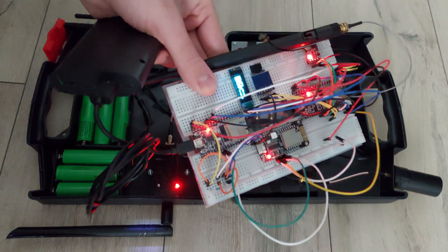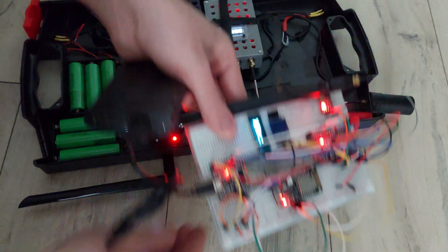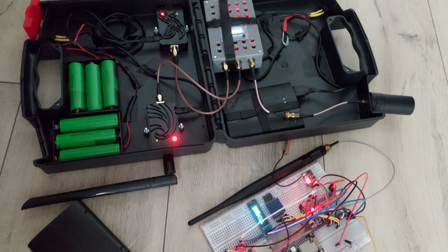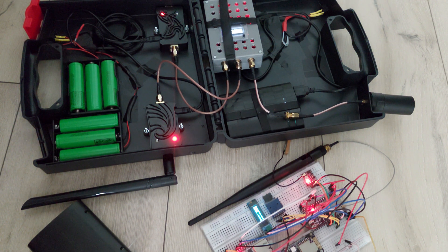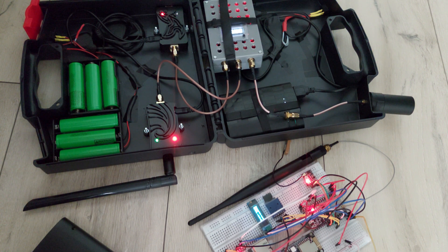I will try to do a comparison with this wardriver, but it has some issues because the jumper wires are very thin and I think the breadboard holes are now larger, so the connections are not very secure — sometimes it gets an unexpected error and resets. I had a video about fixing this if it disconnects when it tries to boot up. I spoke to Joseph and this issue should be resolved in the next update — he has already patched it.